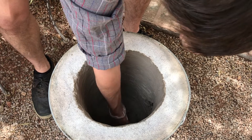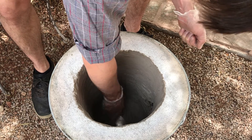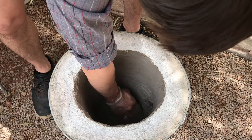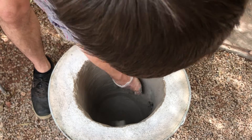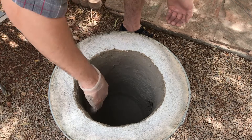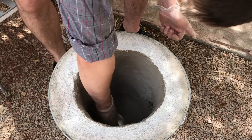I actually bought five pounds before to coat my other furnace and it was just barely enough. It's better to have more because you're going to have to end up patching this stuff when it cures, because it will crack a little bit. My experience has been that after it cracks, if you just fill it up, it doesn't re-crack. You just fill those cracks and you're good. This stuff does require a little bit of maintenance, so it's better to have some on hand.